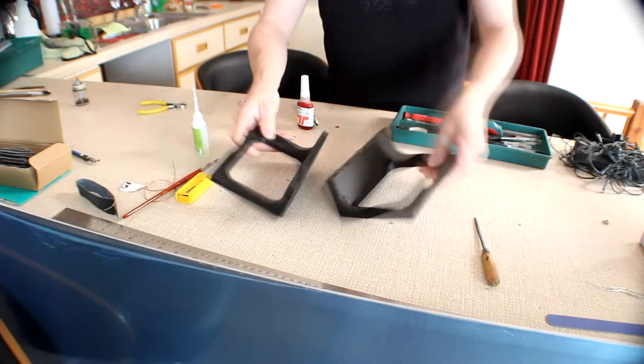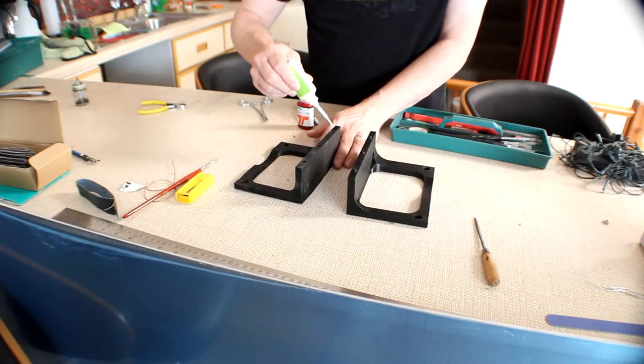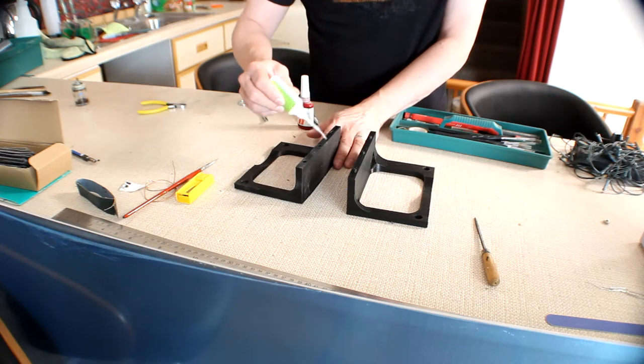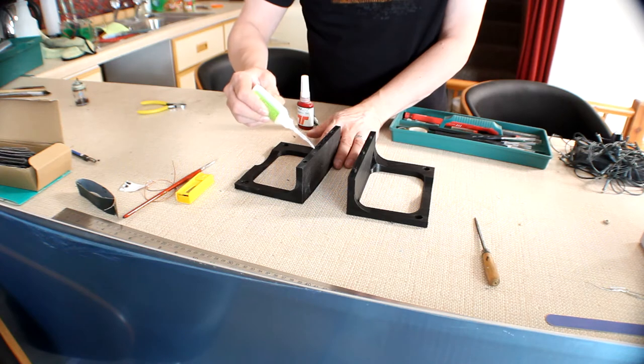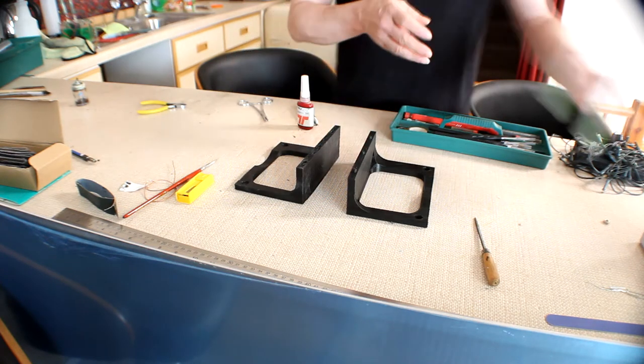And so we're going to use the trusty old 3D printer for this, and you can see it there making one half of the frame. And the reason for that is the way that I designed the frame, we can't print it out in one go. So we're going to have to print it out in two halves, and you can see we've got some indexing holes there. And a quick line of super glue on this should be enough to stick it together, because it's going to be essentially bolted in place anyway, so it'll be nice and rigid.